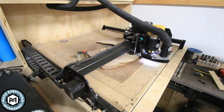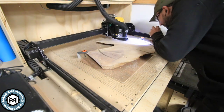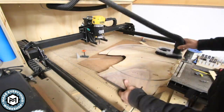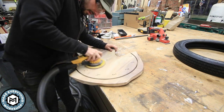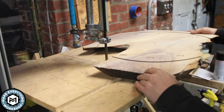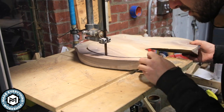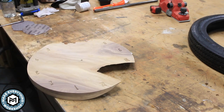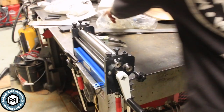I didn't cut all the way through the slab because it was a little uneven, so I stopped the cut a little bit prematurely to avoid any damage to my machine. If you're ever going to make something like this, try to flatten the slab so it's parallel on both sides before bringing it to your CNC. I took 80 grit sandpaper and sanded out that score line — it was pretty light so it wasn't a big deal — then sanded away some of the fuzz marks from the engraving bit. I went back to the bandsaw and cut really tight to the edge profile, which freed up the perfect circle the CNC left. I then sanded that edge by hand rather than using a router with a pattern bit, since the uneven top made me want to avoid any more mistakes.